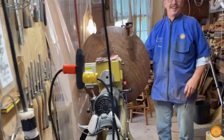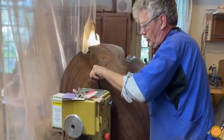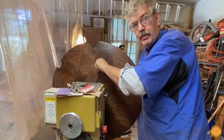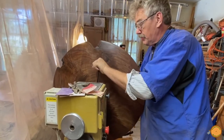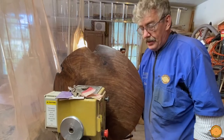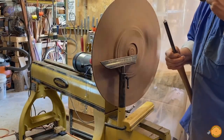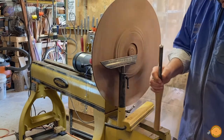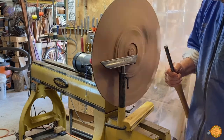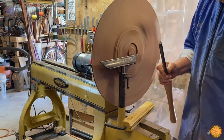And here's Doug wrestling with his ginormous platter. It's a branch — or either the branch or the root — but I got it from Ben Kaufman. A couple of pieces; this is one of the two pieces. It was 32 inches wide. I got that at 250 RPM. I tried my Ellsworth tool on this, but this 40-40 gouge grind that Trent Bosch recommended when we were doing his last demonstration — I find it works a whole lot better.